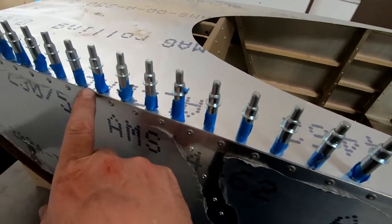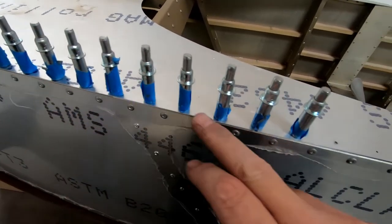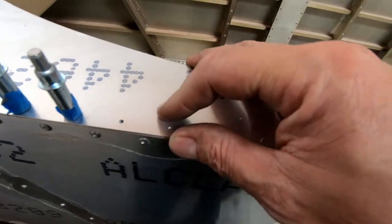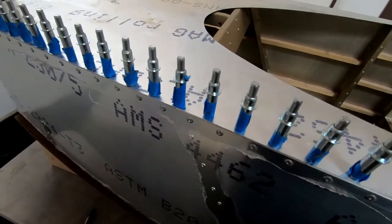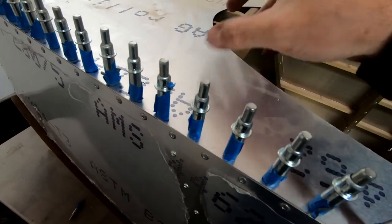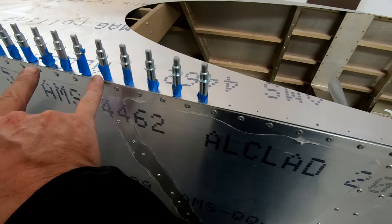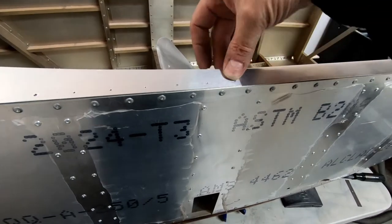Now, that's easy to fix, because after I get done drilling all these in, I'll mark that and I'll come back with a sander and sand the skin off here so that it's perfectly flush with where it should be, which is the edge of that angle in there. Of course it comes back now to being where it should be, and it seems to stay where it should be all the way back to here. So it's not something that I would want to try and pull the skin in to meet up with the fuselage, because frame 2 is holding this together. What it would do is start buckling this skin up here, which I don't want to do. So I'm just going to worry about that later. I'll mark it, and then I'll keep going here and keep drilling these out and installing the clecos all the way back to the middle of frame 4.